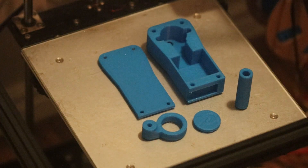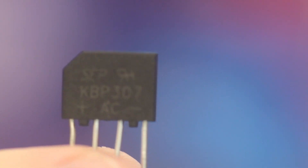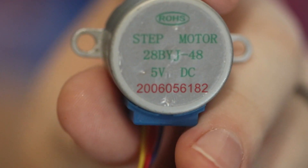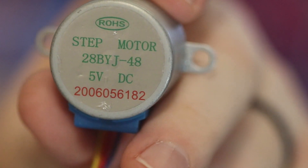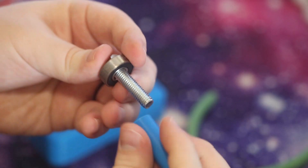You're going to need access to a 3D printer to print the parts, four M3 knurled nuts, two KBP307 ICs, a DC LED light source, one 28BYJ-48 stepper motor — you don't need the driver though — one 608 skateboard bearing, and one 5/16ths or M8 bolt.